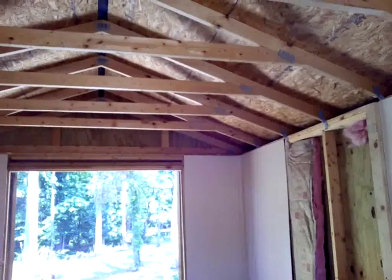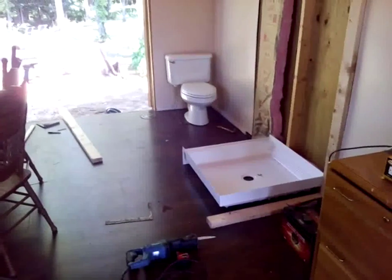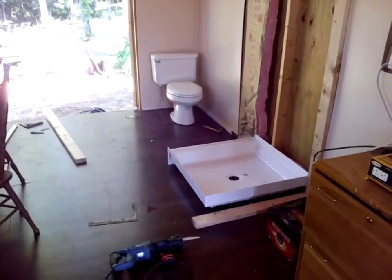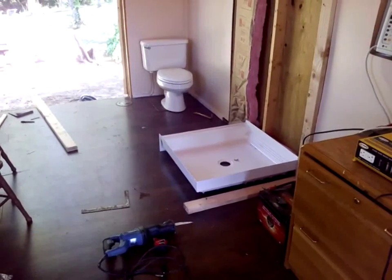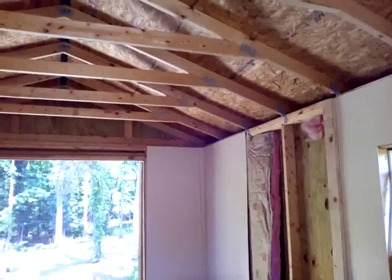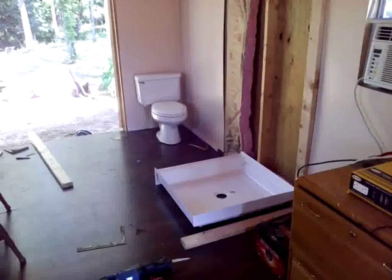So I'm short. There's no stud that I have here that's going to be long enough to make this exterior or this interior wall. Now, I have wood here that I could do something and make it work. However, it would not be right. And if you want to really mess something up, start fooling around with stud walls and doing things that aren't standard procedure. And definitely when you're turning a corner, I've got a corner post I have to make here, and there is no way that I am going to try to jury rig something to go to this 107 inches. So I have to go to the hardware store and get a 10-foot stud.